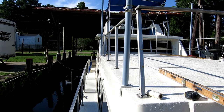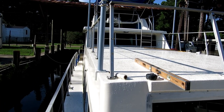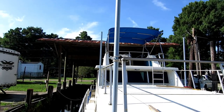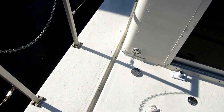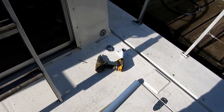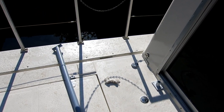Now I'm on the port side. The front post is set permanently — base screwed down and pulled with the string to level. The back post is set in an arbitrary position and with the help of a block of wood, a C-clamp, and some string it is pulled level. I'm going to pull my string to set the tall post, but the front-to-back position is already established because I'm matching the one that is screwed down. All I have to do this time is get the side-to-side position by holding the string and level at the same time.